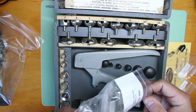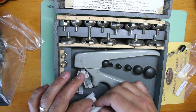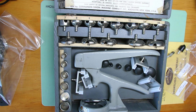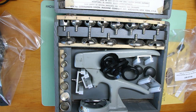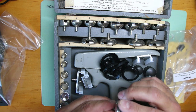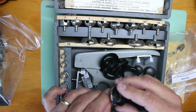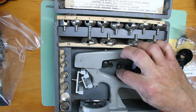There's a set of four square adapters that I can now add to the box. The other thing GS has come out with is little plastic inserts for the adapter cups. Here's a bunch of those plastic rings — there's a number on the back. This one is number 15, and it fits perfectly into adapter cup number 15. They don't even fall out. These are to protect sensitive surfaces like a brand new crystal or your watch case.